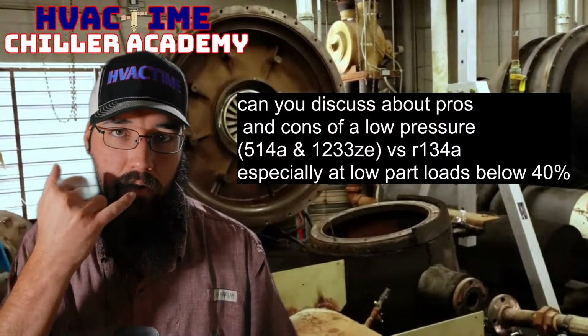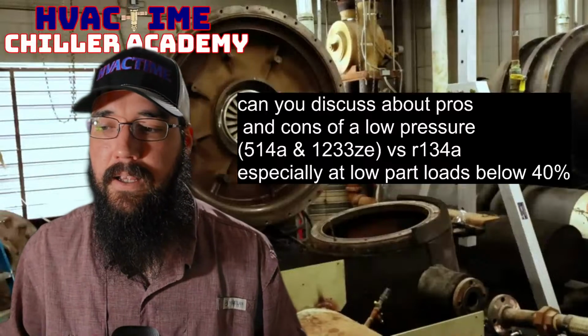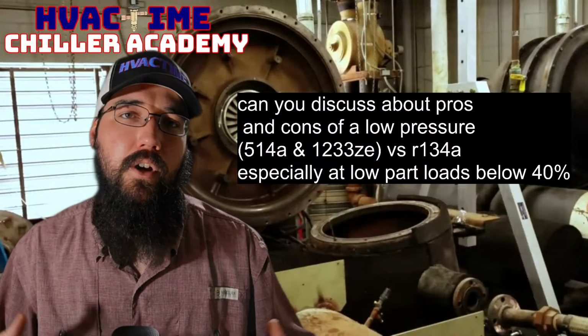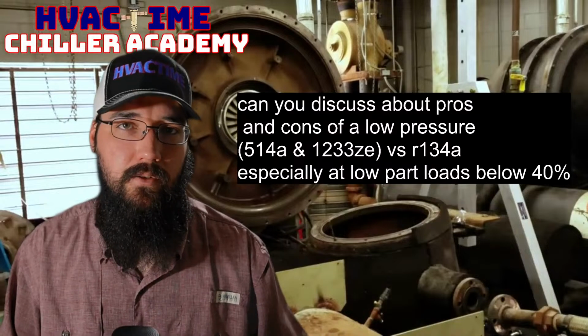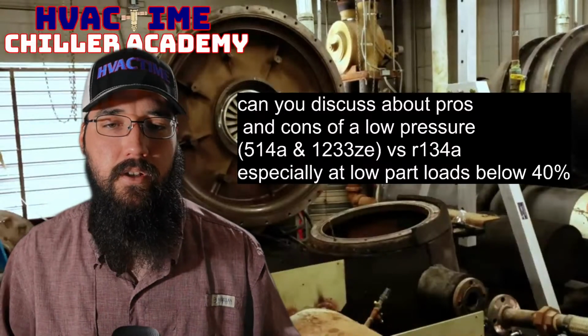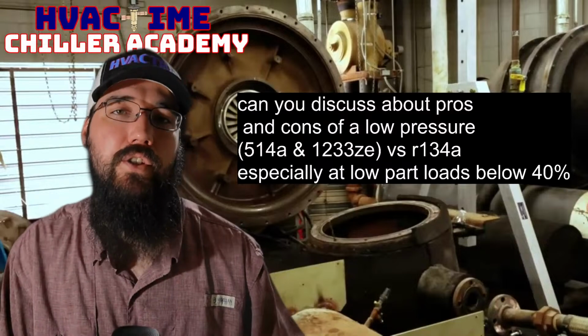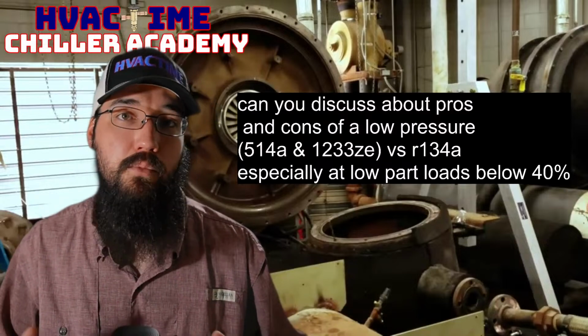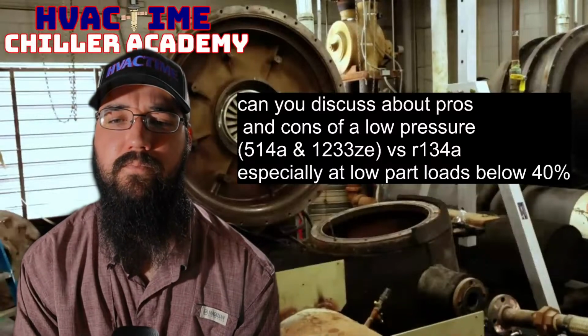Now, if you're working on a small low pressure, it's not that big a deal. But as that scales, your recovery machine and such, that equipment can become kind of a challenge to use efficiently, in order to not take absolutely forever to move that refrigerant around.